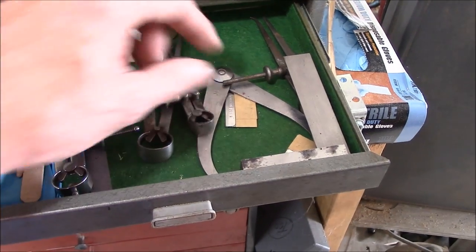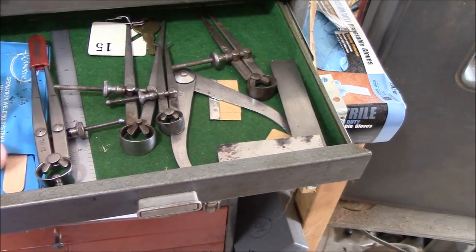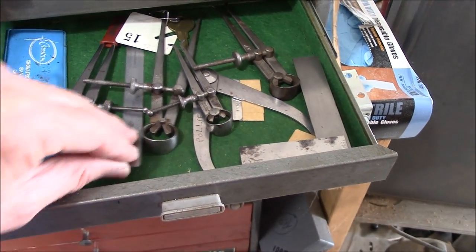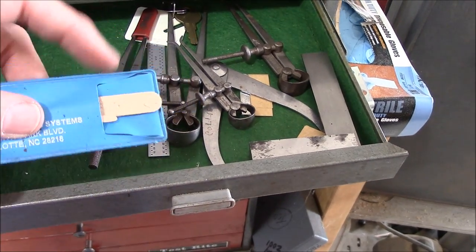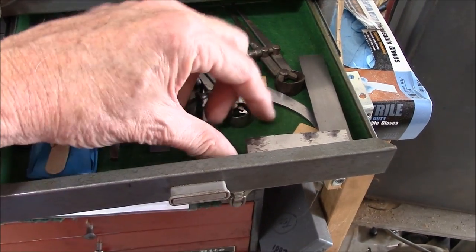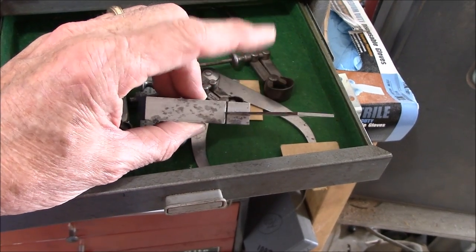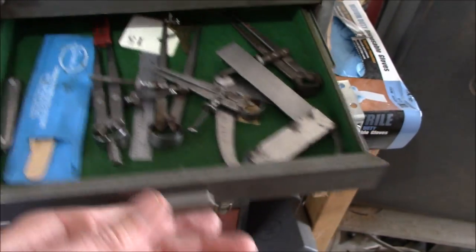This is a set of inside calipers, and this is just another set of inside calipers. A lot of times you find stuff and there's more than one in it. You're also going to need several of these little rulers — they're called scales. That's the official name, and they're going to be everywhere. You'll be surprised at the things you find you're going to need to keep in your toolbox. I also recommend that you get a square — this is for setups and for layout work. It's got the big thick edge on it so you can get your layout done when you're marking on your metal.